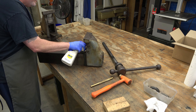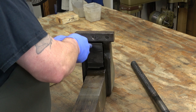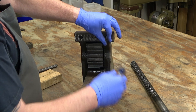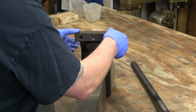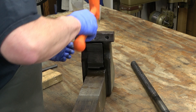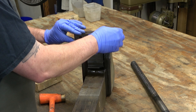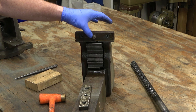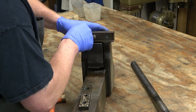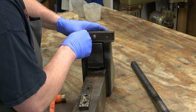I'm using a little bit of WD-40 to loosen up these pins that hold the pipe jaws in the dynamic jaw. We'll go ahead and remove the two screws that hold this jaw insert in the dynamic jaw. These are just rectangular jaw inserts. The C-Series never got a T-shaped insert, like you may see on the S-Series or the N-Series or on some Colombian and other brands. Sometime around 1959 to 1962, the C-Series got replaceable jaw inserts.